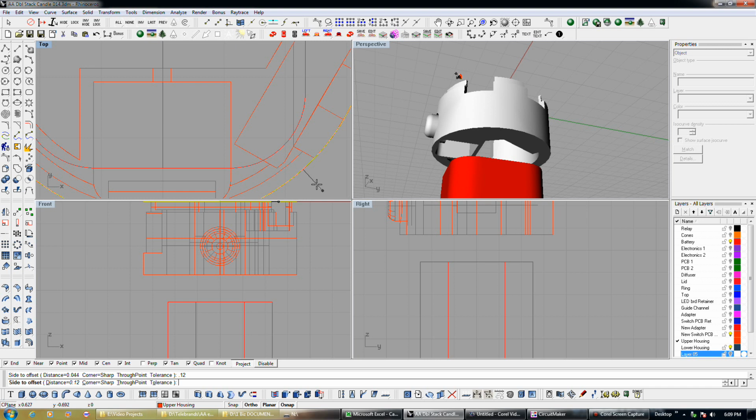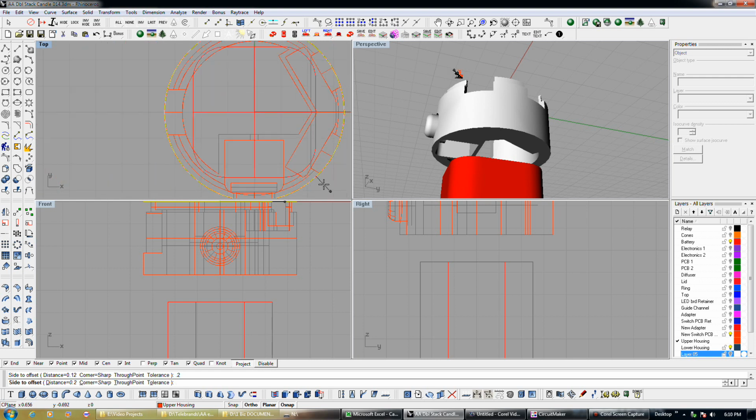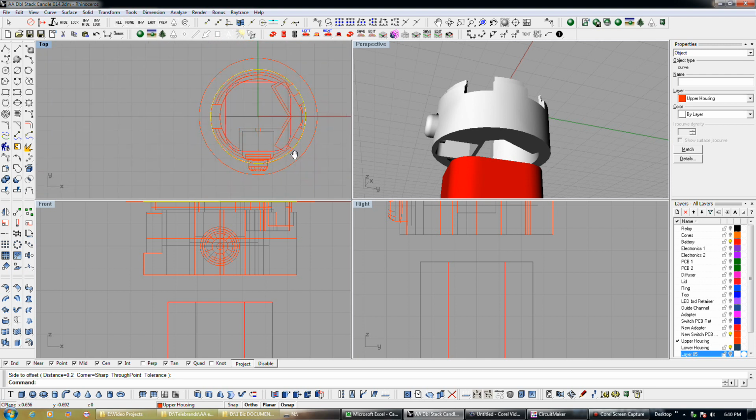outer wall, or for the inner wall, actually. Well, the inner wall can be where that outer wall is currently, and that's fine, because that gives us an eighth of an inch, as you can see there. That would be fine for an inner wall, but the outer wall needs to be an eighth of an inch plus any kind of wall thickness, which is really about 3/16 or more. So really it almost needs to be 200 mil, unfortunately, which is making an awful wide candle base. It's over 2 inches in diameter for the base.